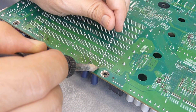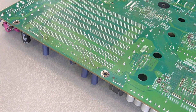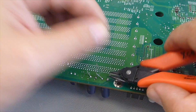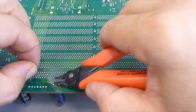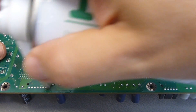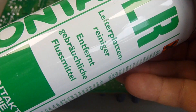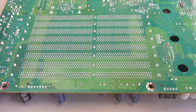You have to rest the soldering iron for a moment on the board to heat it up — if you hurry, it will not work. You can also see how the solder gets sucked down the hole in the board. That's okay, and you need that time — the soldering time — to get the heat to the other side of the board. When I lifted the soldering iron, I rubbed it against the wire ends. This is to prevent any solder mountains or spots on the solder pad. If anything sticks to the soldering iron, it sticks to the wire of the capacitor and that is cut away, so we get a nice looking solder joint on the board.